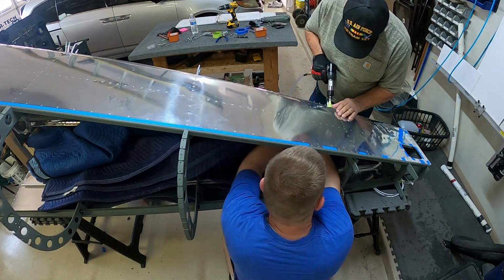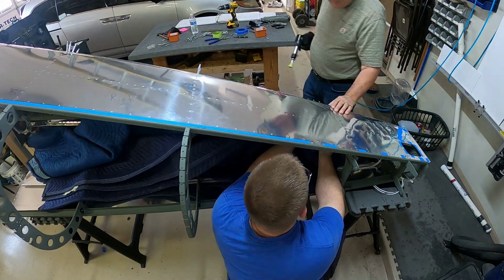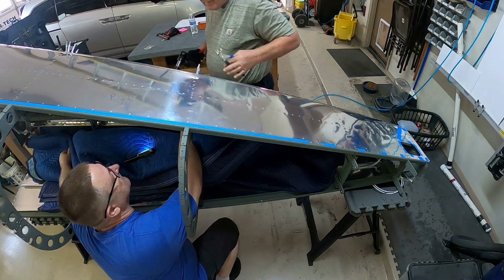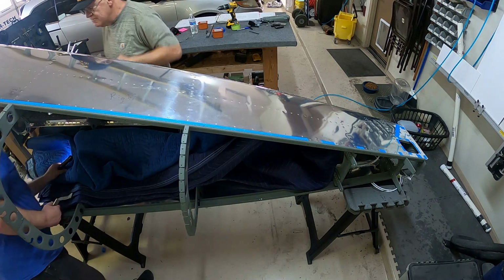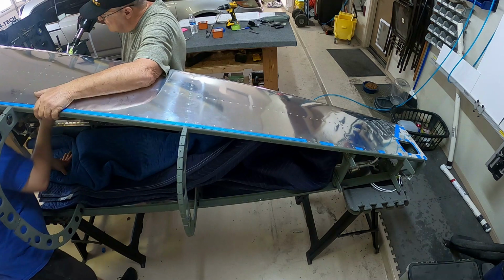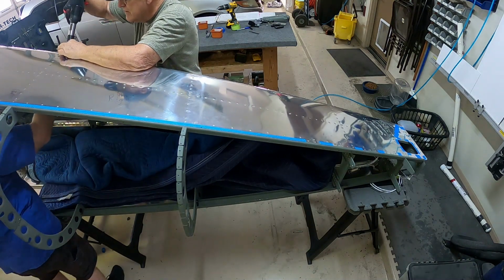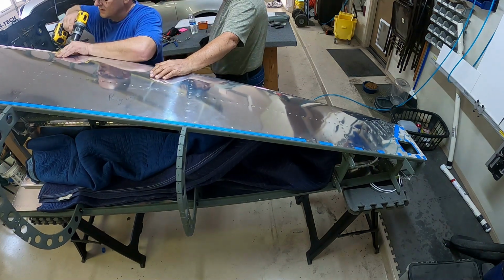And so here we are. We're doing the bulkheads around the corner. I don't know if you can see the clecos in the bottom there, just barely. We're doing the bulkheads down to where they're at the bottom, and then you'll see us do the very bottom of the skin. So the right aft fuselage skin gets attached to the bottom skin, and you'll see us do that here. I think I changed camera angles for that so you can see up in there.